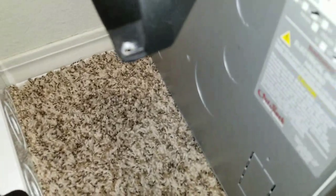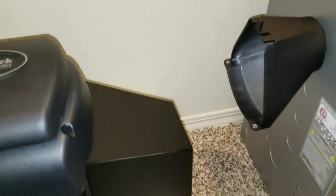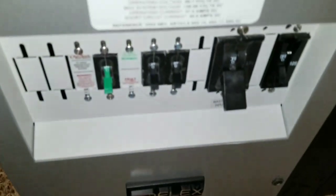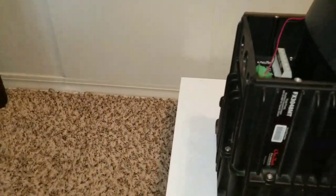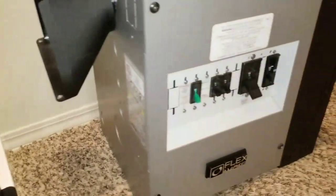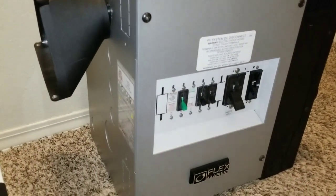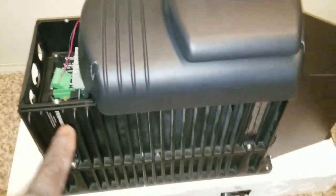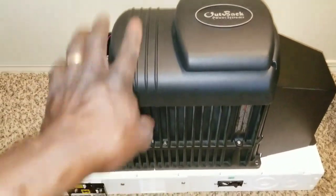There's another big one here on the DC side — both inverters are going to be sitting in parallel, that's how they run. You attach the other one horizontally on the wall. The AC side is going to look just like this but on the other side, attaching all the AC wiring to a similar box on the other side. That setup is for my next install where I'll be utilizing those boxes instead of this single-inverter mount.